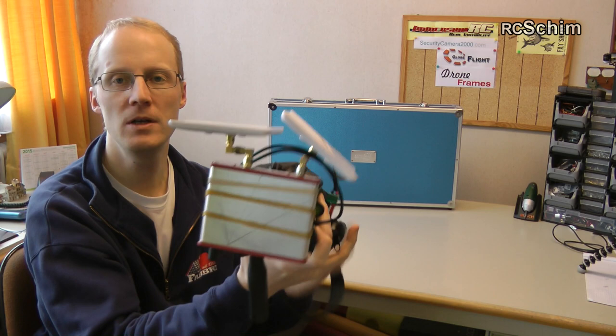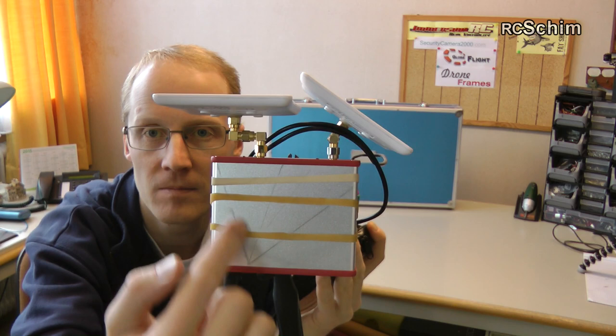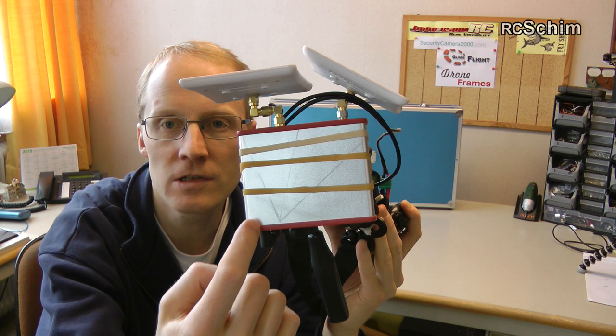Little tip here, as these antennas have around 35 degree of opening angle, like this, I just did draw the angle here with a pencil and mounted the second antenna tilted half the way. So all in all, I have 70 degree of radiation beam, and that's a decent range. So at the field, I just look on the lines here and know approximately where I can go really far and really safe. So it's really important to know what radio frequencies are used, what is out there, and how does it work together, what device influences or interferes with another device.